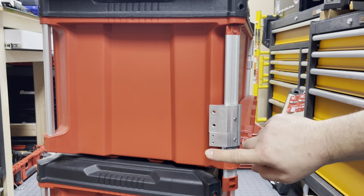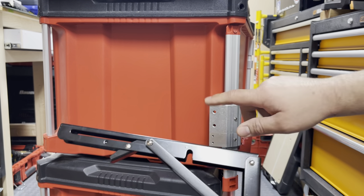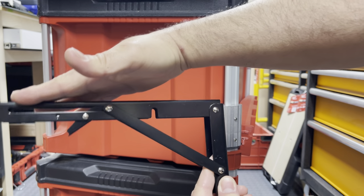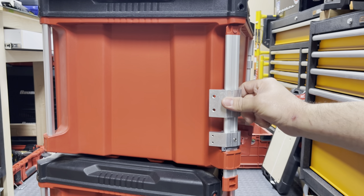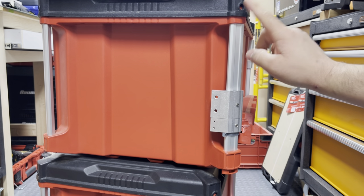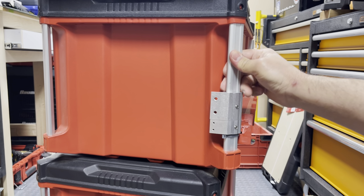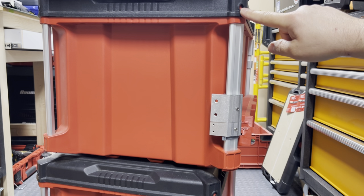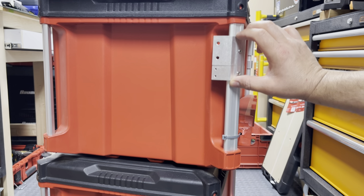The large ones are definitely more heavy duty than the bottom ones. They take quarter-inch screws - I believe number six screws on the small one. I'm putting the larger heavy-duty one on top because the weight of the L-brackets is going to be right there, and the bottom one will be a smaller pivot point. Slide them on in the configuration you want - there's no turning back after that. If you do this several times it will wear out. I'm going to use a little mallet to snap it back into place. You can always put a screw in there and it'll never come out.